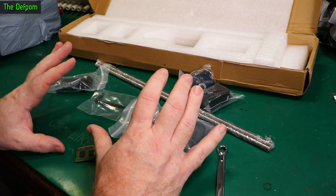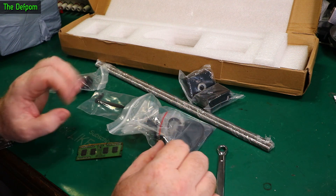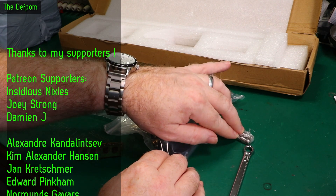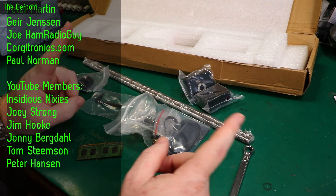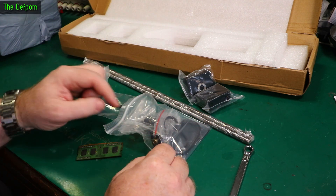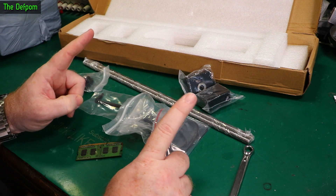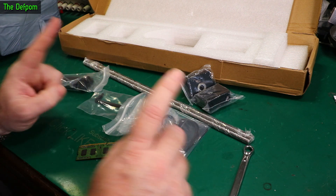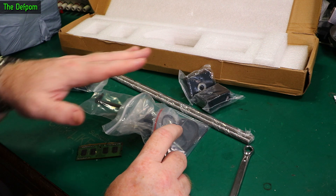I'm not going to strip off the dual stepper motor — I quite like that setup. I like the geometry; it's going to be quite even. If you've got belts, you're always going to have a little bit of play and slack, so having the dual steppers is better. What I wanted to do is merge the two together: tie the tops of the two Z screws together with a belt and use the two dual steppers. That way they cannot go out of sync. Once they're set up, that's it, because you won't be able to shift enough on the belt to go out by much. Currently you could potentially shift out by a quarter of a turn, but not with a belt joining them. Both motors will be in sync, with enough play in the belt that they're not fighting each other.